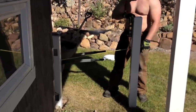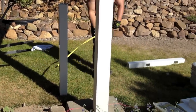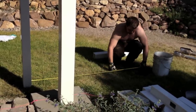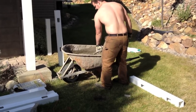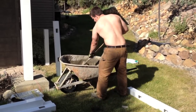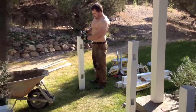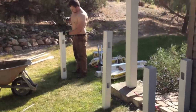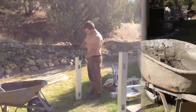For this section, we're going to have a 36-inch gate and one panel. Make your measurements and then get your next corner or end post in. Fill that hole with concrete, and then drive it down to about 2 inches above the ground. Then you'll level it up.